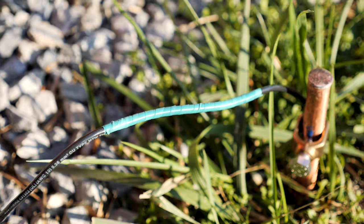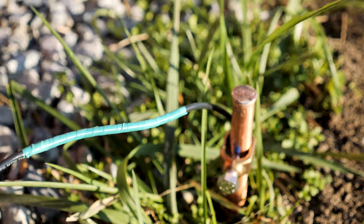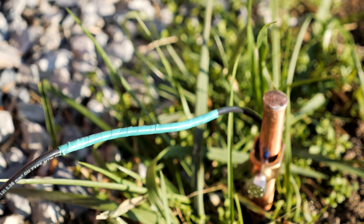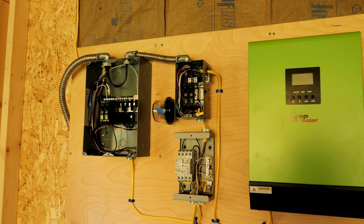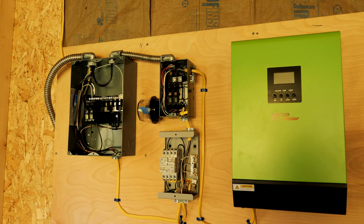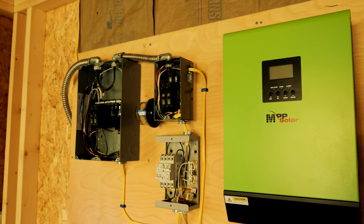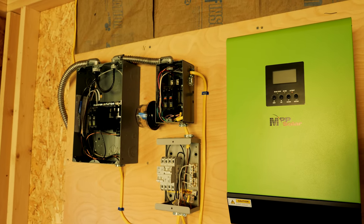Adding this grounding source is critical for all the components on the AC side, and this will also serve as the grounding rod for the DC system and the solar panels. I'm going to finish up the video now — cold weather is on its way. I need to work on the batteries, the battery box, and then get the solar hung. About a third done on the project.